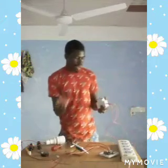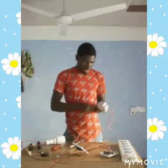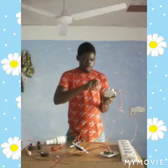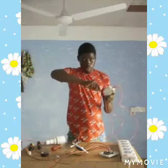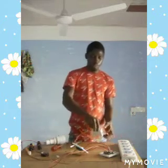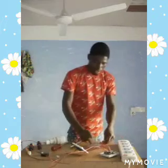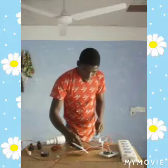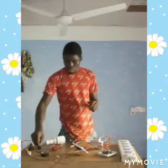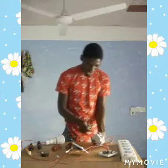Here is our live from our wiring diagram — you connect it to the live terminal of the RCCB breaker. That is the work of it. Now we connect our neutral from our wiring to the RCCB neutral terminal, which is demarcated by N.